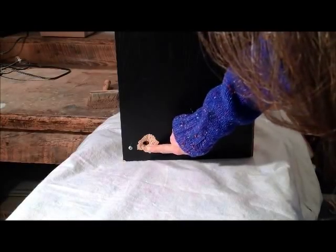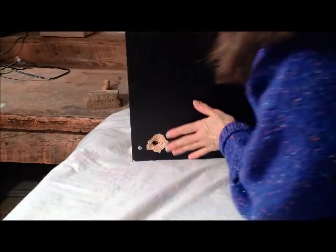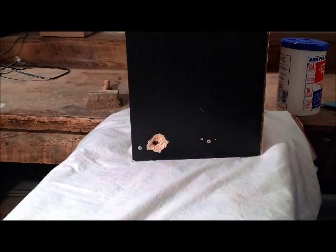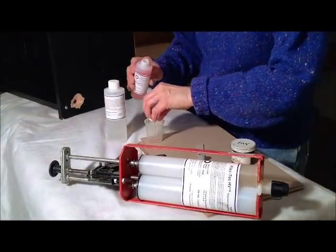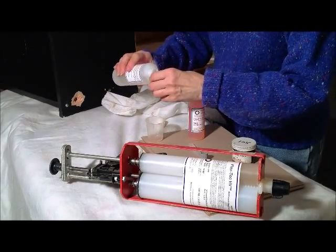Art's Flex-Tec Epoxy Repair System may also be used to fill large holes left in particle board cabinets or bookshelves. Once again, mix and apply the Primatrate. Allow it to set 10 minutes and wipe off any excess.